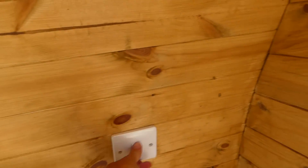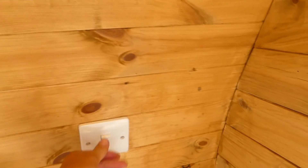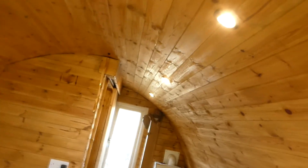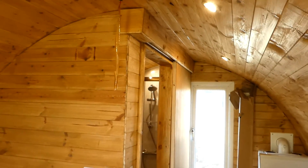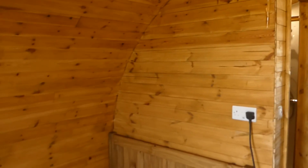And if we do the main room - there you go. I just thought I'd make it dramatic. These are really efficient - three watts each. So three, six, nine, twelve, fifteen, eighteen - that's only 18 watts total off my 520 watt system.